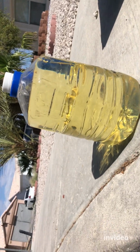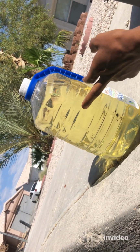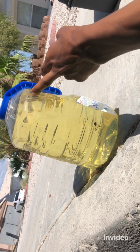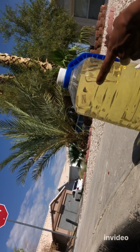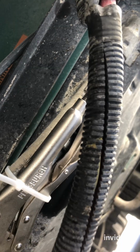So how you can clean your generator is basically right here. As you can see, I have 1 gallon of fuel, and then I put 6 ounces of Seafoam. Yes, I'll leave the link in the description below. So 6 ounces of Seafoam on almost 1 gallon of fuel. What you do is I have another fuel line here. I'm gonna connect the fuel line to this, and then dip it into this mixture, and then run the generator for about 30 minutes.